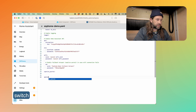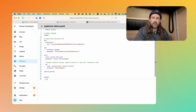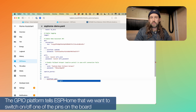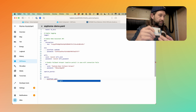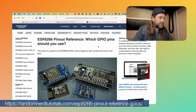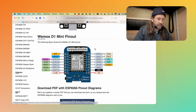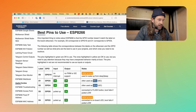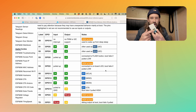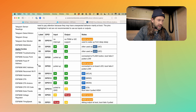Let's add a switch component. We'll hit Return, then dash. We need to tell it which platform we want to use — in this case, the platform is going to be GPIO, that's general purpose input output, which are the pins on this microcontroller dev board. Then we need to tell it which pin. To figure out which pin, I'm going to use a great reference from Random Nerd Tutorials — link in the description. This tells you all about the ESP8266 pinouts. If we find the Wemos D1 Mini, we can see the relationship between the screen-printed numbers and the actual GPIO according to the microcontroller.